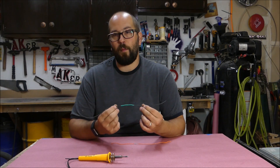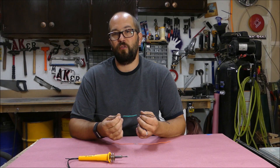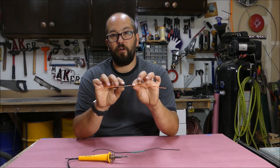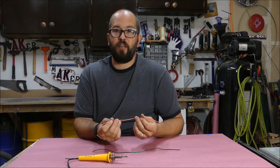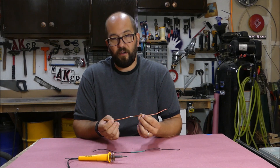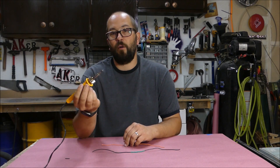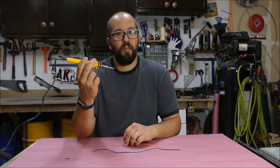Thank you for watching my demonstration on how to solder wires together. I really believe what I'm going to call a modified lineman splice is the best solder repair you can do on a multi-strand wire. It is quite small — barely larger than the wire itself — so it's easy enough to conceal back in a harness or wherever it needs to go. It's a very strong mechanical bond and a very good electrical bond. When it comes to tools, I really believe the $5 pencil soldering iron is your best bet. If you have any questions, please leave them in the comments — I'd love to answer any questions about soldering and discuss why you might feel a different solder joint is better. Thank you for watching, and until next time, peace.